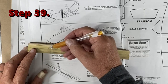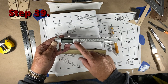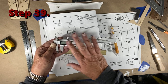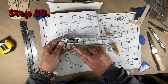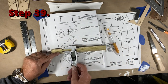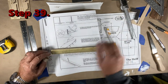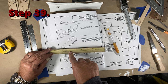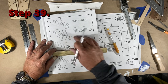Here's your center line — you're going to go out five-sixteenths of an inch. For me it's easier to use a digital caliper. Although it does inches or millimeters, I switched to millimeters — it's just easier for me. I converted five-sixteenths and in millimeters it's 7.95 millimeters, so that gave me the distance. You measure from the center line out and give yourself a line on each side. Those two lines go up to that six-inch mark from this end, which takes us through step 38.